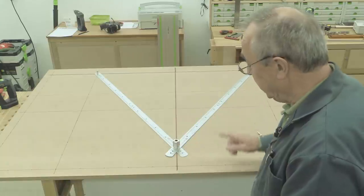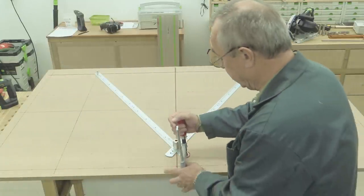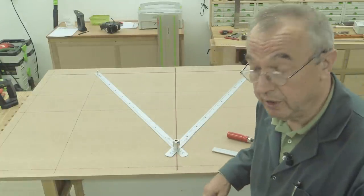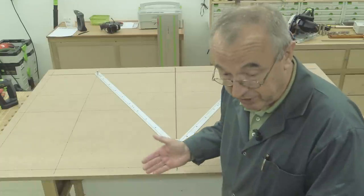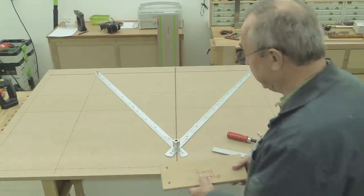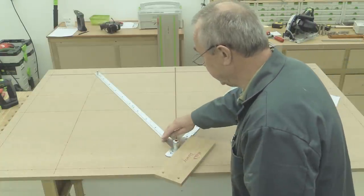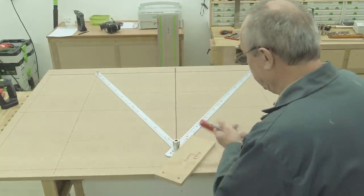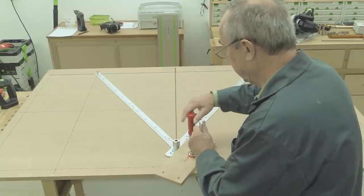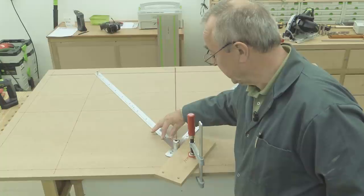It won't move. Now, it's not always possible to have a clamp that goes that far. In fact, mine is pretty touch and go. So you can extend your clamp very slightly. It won't be quite as strong, but it'll be good enough. And all you do is just take a spare piece of wood, put it across like so, making sure again that that is properly seated. And what we're going to do now is try and get this as far in as possible and clamp. And that will be exerting some pressure down onto this one here.